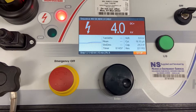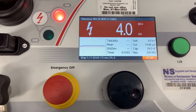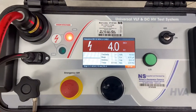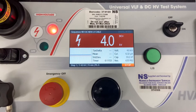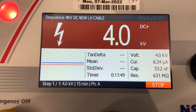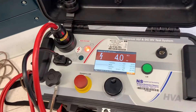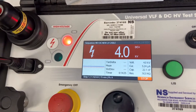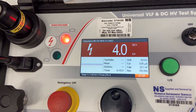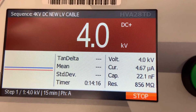The figure shown is the leakage current down to earth; there's an overall capacitance value and a resistance value. As the test goes on, the resistance value on every core we checked — some started as low as 40 mega ohms, but by the end of the test we were above 200 mega ohms. We passed the report back to the cable manufacturers who approved them, so we were safe to then energize the system.